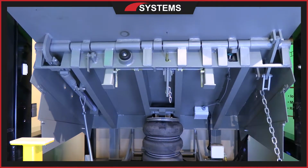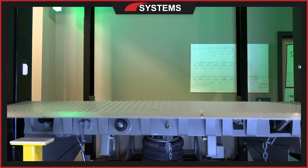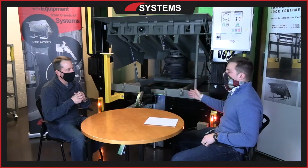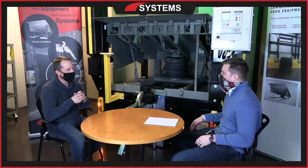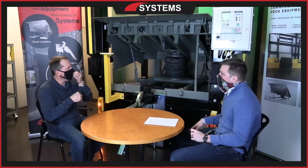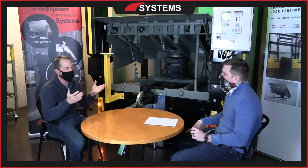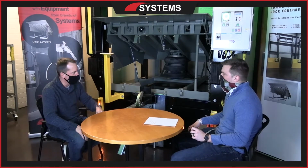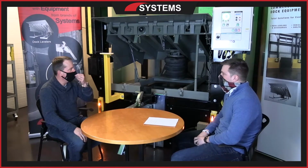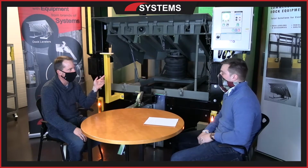And you touched on installation. I know some people might be maybe thrown off by using compressed air at a dock. Can you touch on, what's the difference between installing a CA and installing a mechanical or a hydraulic, I guess, in terms of time spent? There's probably, from the standpoint of just basic mechanical install, no difference at all. I mean, we're putting a leveler in the same size pit that we would if it was a mechanical or a hydraulic leveler. The difference would be that you have to run an air line from inside the building to the bellows to make the bellows operate.